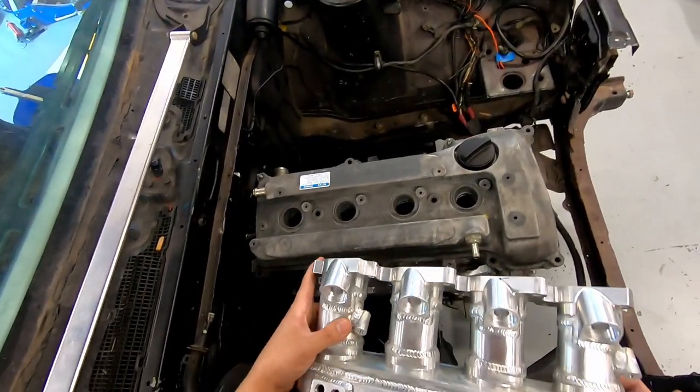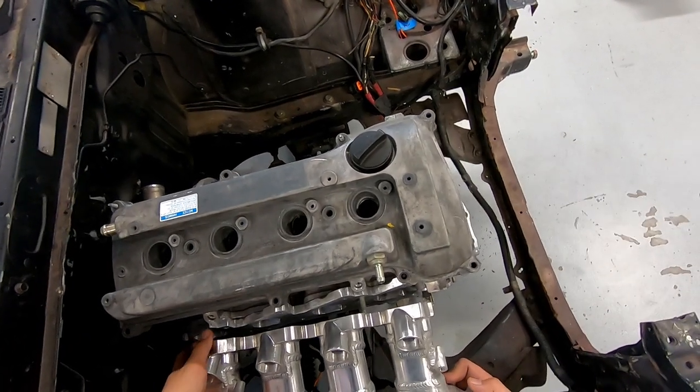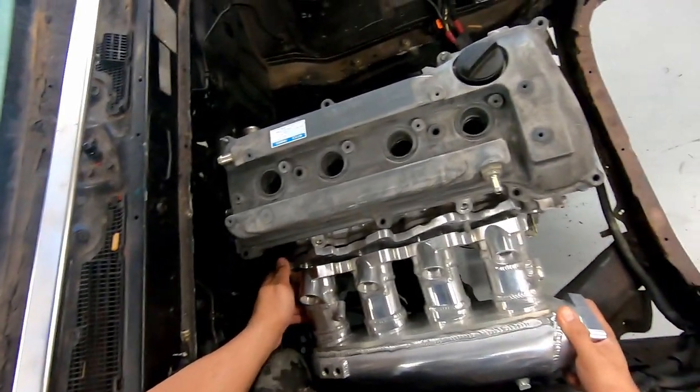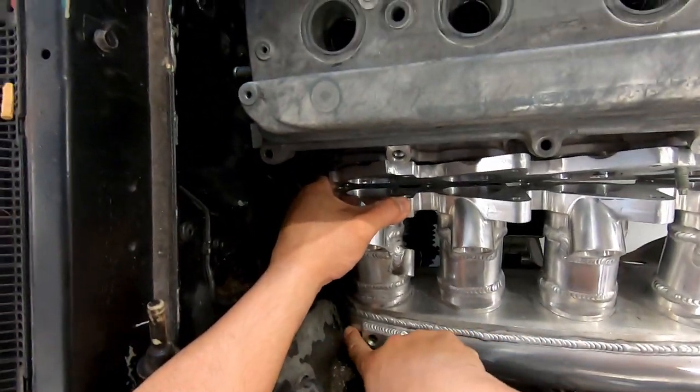Now let's go ahead and fit this to the car. As you can see, this won't fit with the standard booster in place. Given that it only needs another 15mm of clearance, this would easily fit with a smaller booster from somewhere like Flo's.